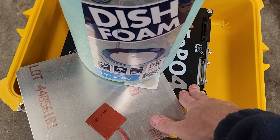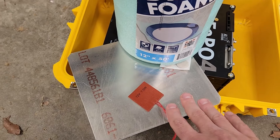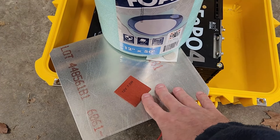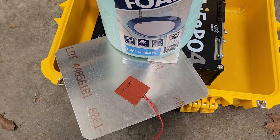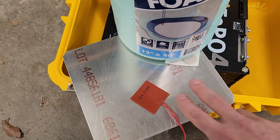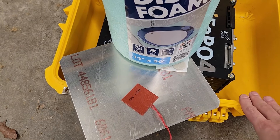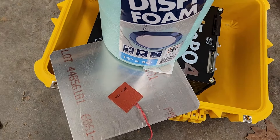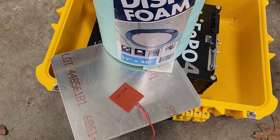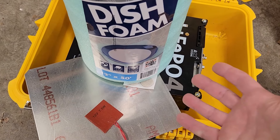These batteries have a lot of thermal mass, so it's not like they're going to go straight to freezing on a cold night. If you start heating them — turn these heaters on maybe around 40 degrees Fahrenheit, which is three or four Celsius — it will get through the night. Also, you've got air in here that, when this lid is closed, will act as an insulator since you're not moving the air, so you're retaining the heat a lot better than you think.